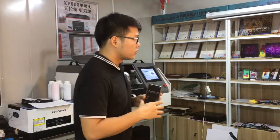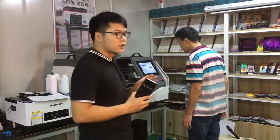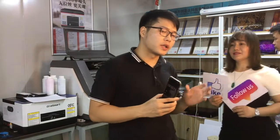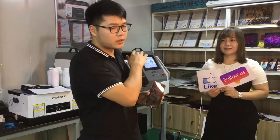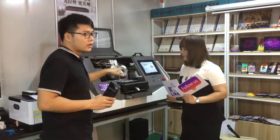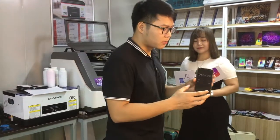When the print is done, we can test the height and observe the color and white quality. We can also put water to test the ink — check ink fastness. When the machine finishes printing, we can move the print heads to the middle of the machine and clean the ink. You can see the cleanliness of the print heads, the white circulation system, the ink pump, and the ink pad. Now it's printed — about 4 minutes and 13 seconds.